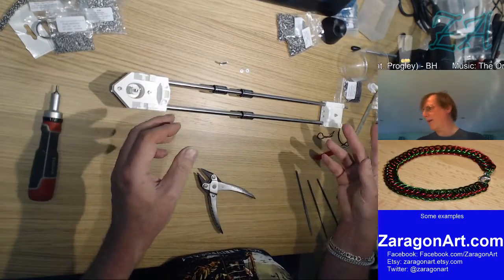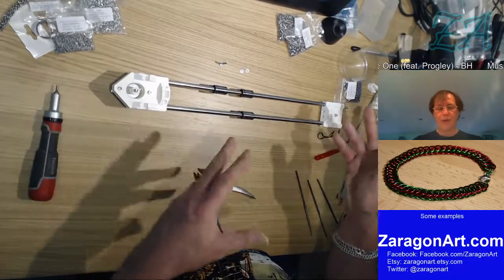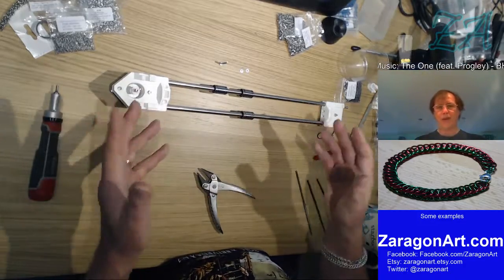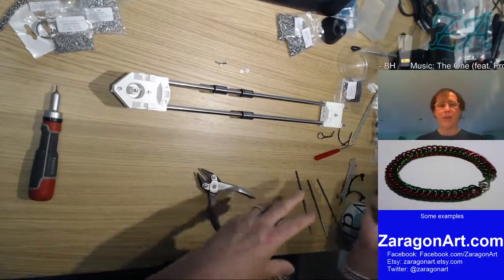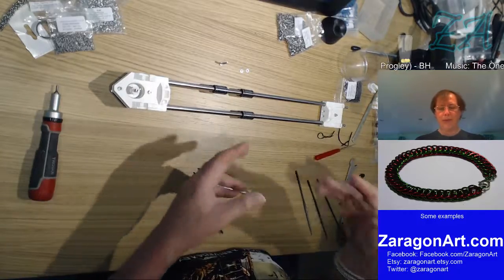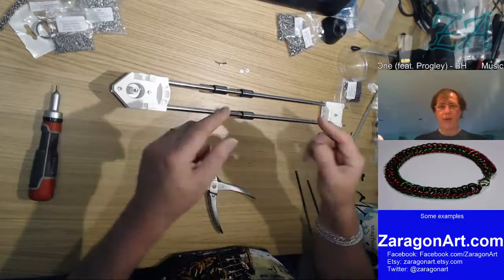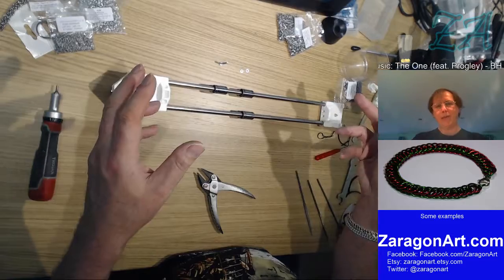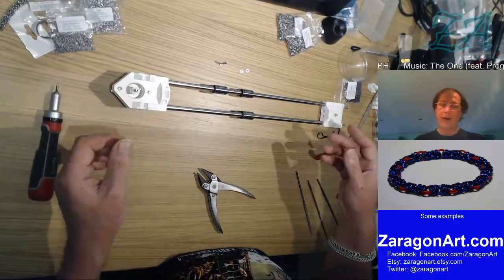I've spent quite a bit of time aligning and measuring and adjusting to get the frames to be square, the rods to be vertical and parallel to each other and these sorts of things, because the more care I take about that, the better the quality I'm going to get. The newer printers, instead of using threaded rod, use a folded metal sheet which can't twist and can't misalign, so all that work's taken out for you, it's already done, and so it's a lot quicker to build.